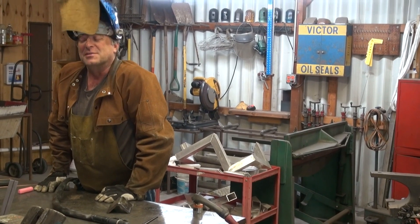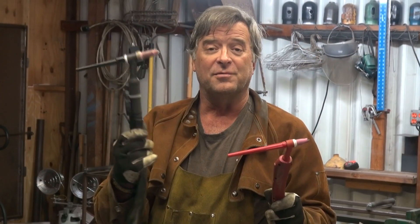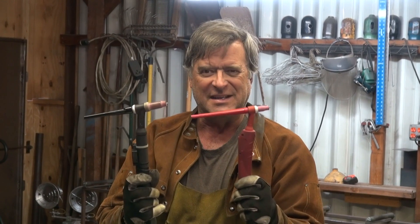Well, there's a good question. Just so happens I've got both of them right here on the bench. My air-cooled torch is a WP-26F and my water-cooled torch is a WP-20. The 26F has to do with the size of the head, the cup it uses, and the consumables — it's all about up here. The 20 has to do with here because it's so much smaller. That's the big difference between the two.